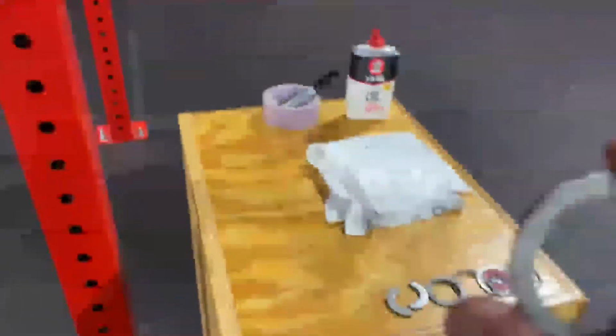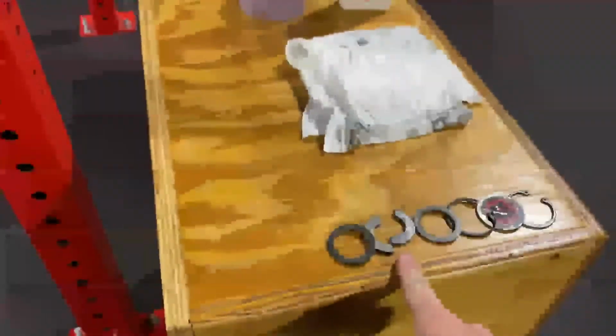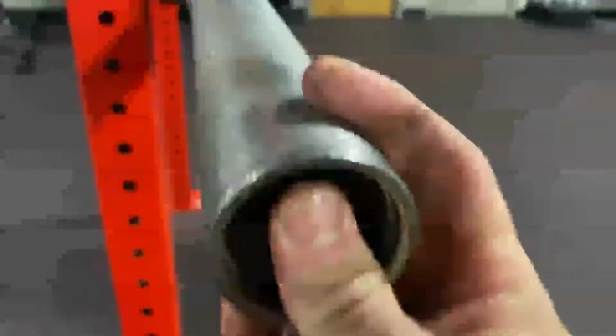Next one that comes off is another spacer. And then sometimes there's a shim in there, in between that spacer and the half washers. This one does not appear to have one. The other side actually had a shim, which is interesting, so I'm surprised there's not one in here. But now that we've got all those out, this whole piece will just slide off in my hand.